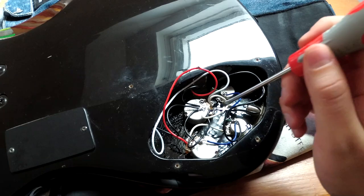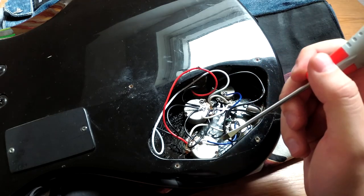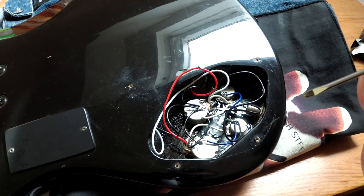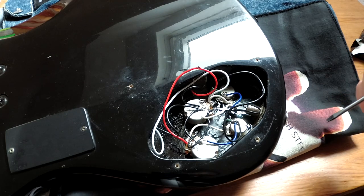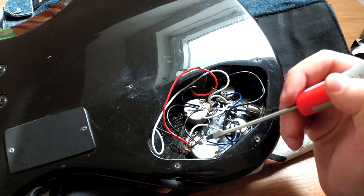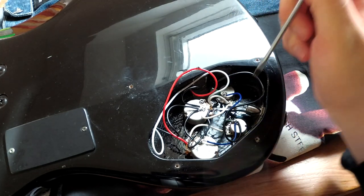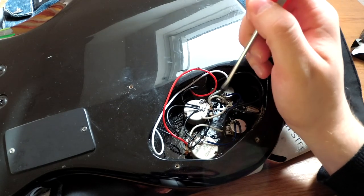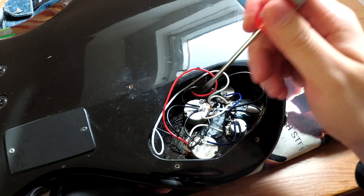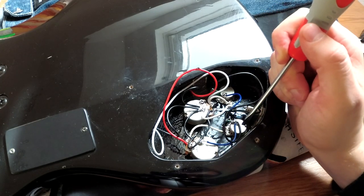The original Jazz Bass also features upside-down wiring which I didn't do, because if you do it the Fender way both volume pots will work as blends, which I didn't really like. The wiring itself was pretty straightforward, though I did a bad soldering job. Bridge goes here, neck goes here, and jack goes there. Everything is connected to ground and each volume pot has its own tone pot.